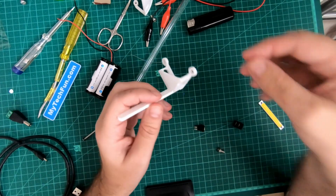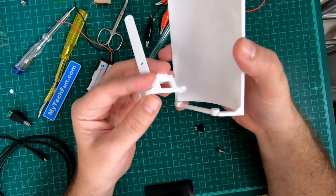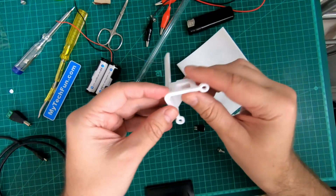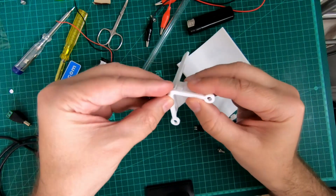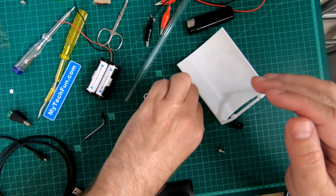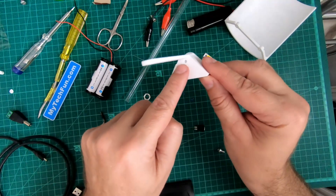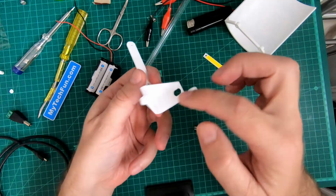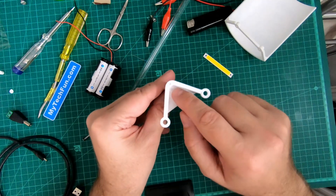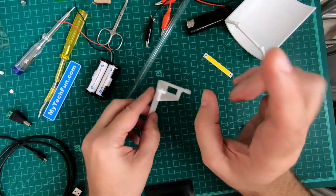This is the LED holder. Since I wanted it to be level — because it goes here — I printed a third leg which I will glue on. Because I didn't want to use support, I want this to be the first layer. I created this hole for the wires, but since this is a bridging hole it cannot be printed in air — it has to be created as a bridge, so I have to make a hole here. But it's only one layer so it will be easy.